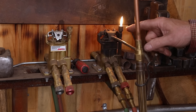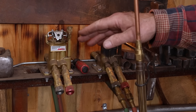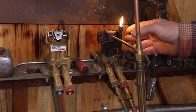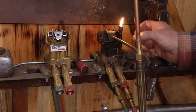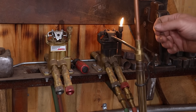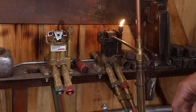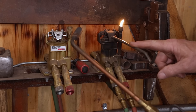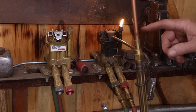The pilot light structure is different for acetylene versus propane, so I need one for each side. Right now there's no gas flowing through the propane side — it's all on the acetylene side. It has a pilot light and that pilot light is adjustable, although the little tube you adjust gets really hot, so once it's lit, make sure you're wearing gloves or use a little pair of pliers to adjust it. It also has this arm, and this arm is a valve. Right now there is no gas flowing through the torch — I can't light it because the valve is off. But when I lift that arm, when there's weight off the arm, you can light it.